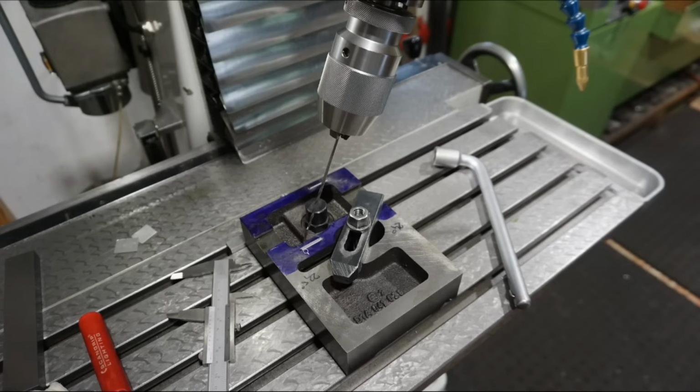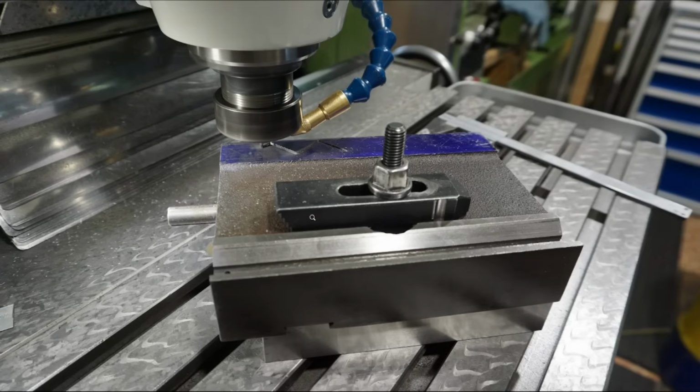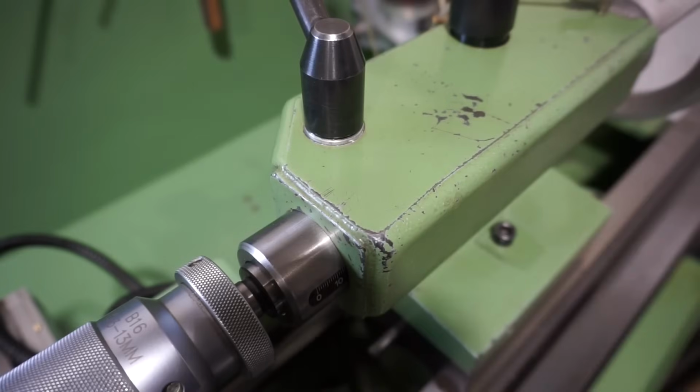and here I'm drilling the hole from the transfer pocket down to the flat tailstock sliding surface, and this one here supplies the prismatic tailstock slide surface. In contrast to the bed slide, on the tailstock I decided to machine right-angled pockets, so using a conventional end mill, and that means losing hydrodynamic lift whenever you're moving the tailstock. But I wanted these pockets to have sort of a way wiper quality to them. Because, well, at least to me it regularly happens that whenever you push hard on the tailstock, it sometimes lifts away from the bed.